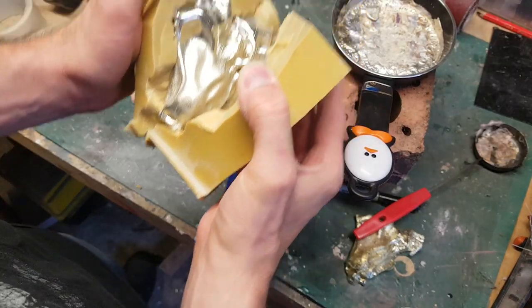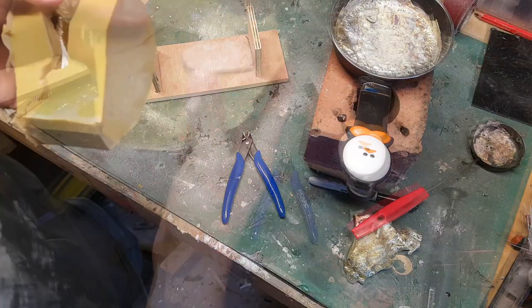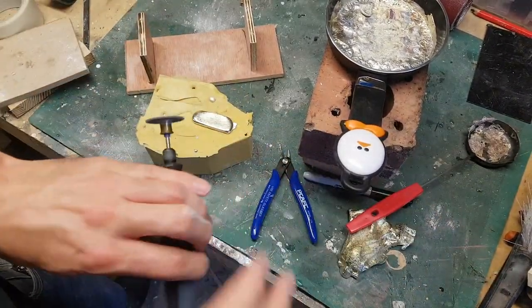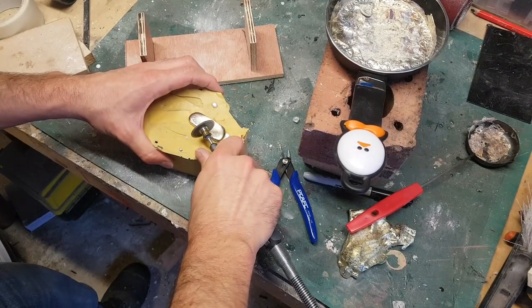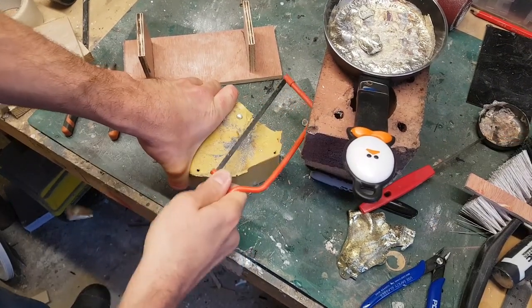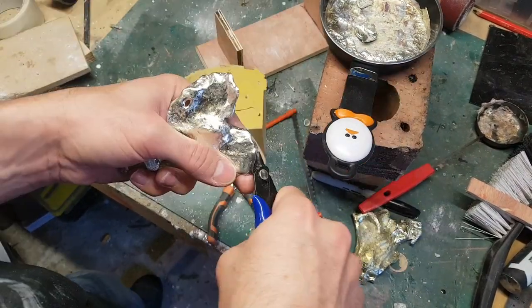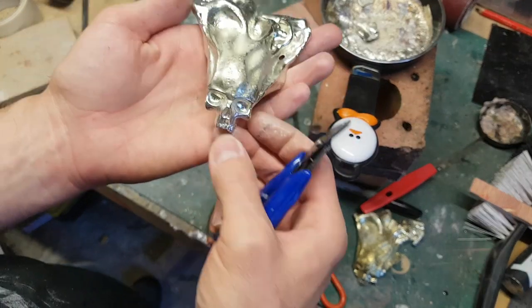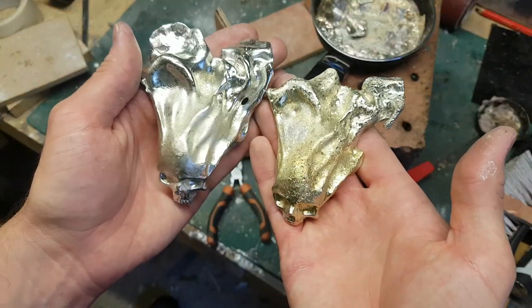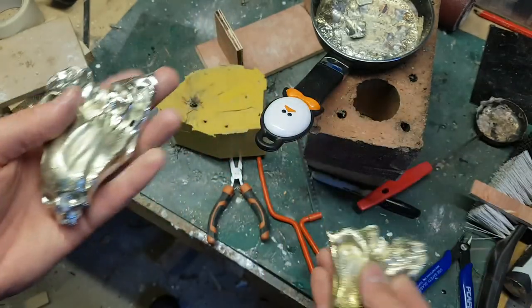At first glance it's looking pretty promising, but since this isn't resin you can't just snap off any excess pieces. There's a block of pewter on the back preventing me getting the sculpture out, so I need to cut that off. After a bit of work to free it, I can snip off where the pewter got into the air channels. The difference the talcum powder made is quite striking — there's a clear difference in colour and also in finish. It's looking pretty good.